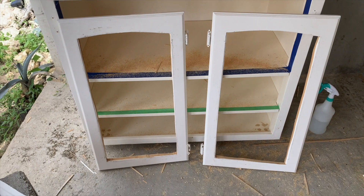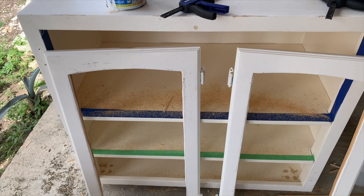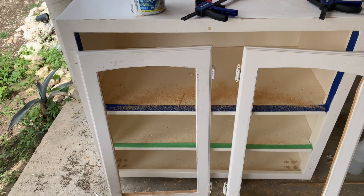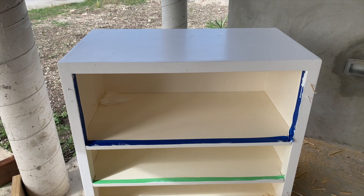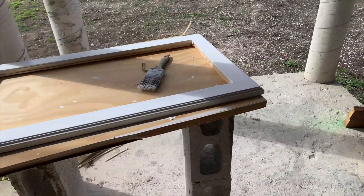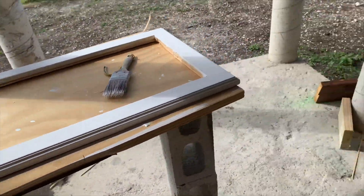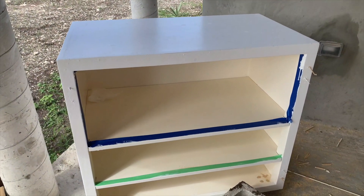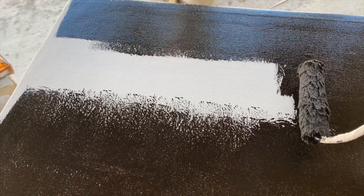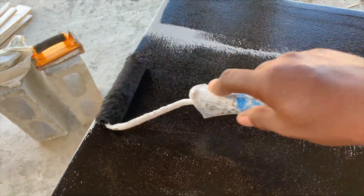So finally got the doors how I want them. The next stage is to wipe everything down, get rid of all the sawdust, and then I'm going to prime it, let that sit and dry, and then I'll go and check on the chairs. I've primed the cupboard and the two door fronts, so I'm going to leave those to dry for a couple of hours. I decided on a matte black finish and will apply two coats.